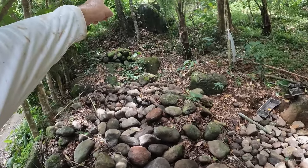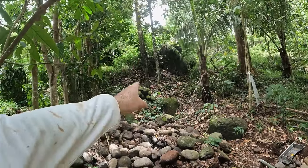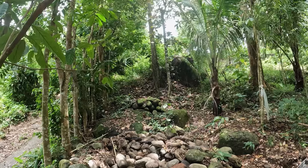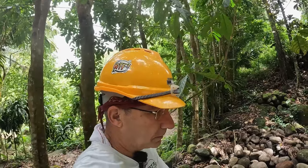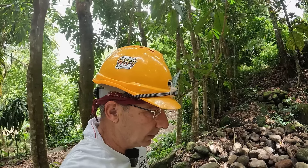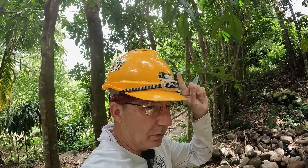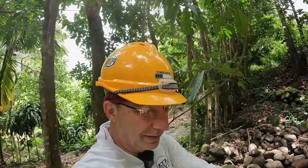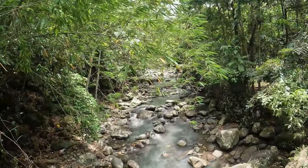This is the exit of the water, and we're going to have to bury a conduit up there — it'll be a chore, but there should be no reason for foot traffic over here so we won't have to go terribly deep. Once I run a conduit I'm going to run electrical wire through there for future use, because we're thinking about tapping the line above to power the pump. I'll also pre-plan some electrical wire in a separate conduit next to the water pipe, and run some Cat 6 cable or fiber — because who doesn't want Wi-Fi in the Chateau Diff?